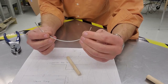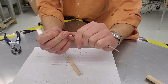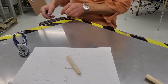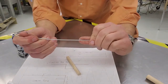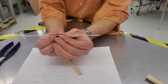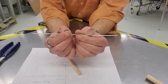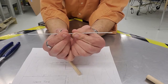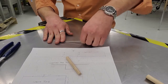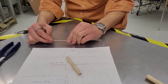First thing we need to do with this is straighten it out. We can start working it with our hands — watch out for the edges, the ends are sharp and can scratch or poke or cut you. We can grab pliers; you can also try using the vices. Whatever we need to do, we want to get it fairly straight. An easy way to check is to put it in your fingers and spin it, or even on a flat surface and roll it. You can see pretty easily where it's got a bend, and then we know where to work. It doesn't have to be absolutely perfectly straight, but the straighter we get it here, the easier it is to line everything up later.